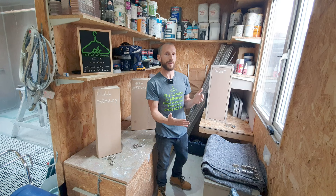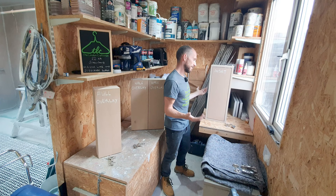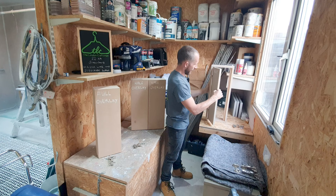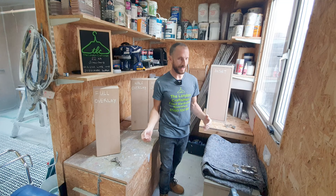The inset hinge is for a door that's going to sit within your carcass frame. It doesn't necessarily have to be inside top or bottom, but at least on the hinge side - maybe you're doing face frames or something along those lines. As you can see, I've pinned on a door stop about 18-19mm away for my door to hit up against, and the door sits within the carcass side - we're not overlapping the carcass, we're inside it completely.